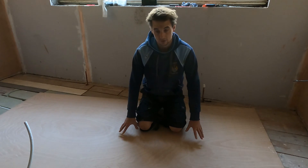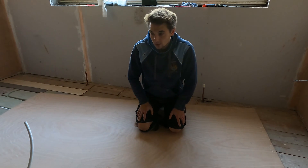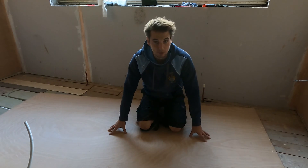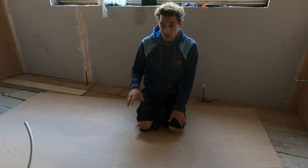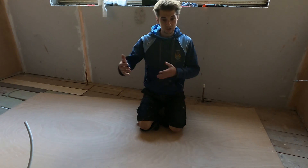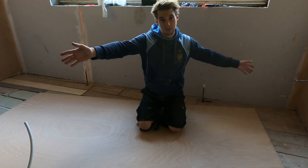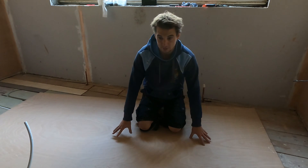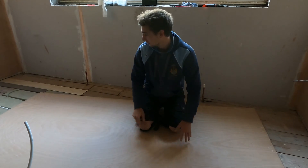For structural integrity of the floor, it does recommend you clean all the floor before putting anything down. The system recommends using 6mm ply; I've actually upgraded to 9mm purely because this particular room is extremely wonky — the joists are on two different setups, going from a high point to a low point towards the bathroom. I just wanted to give it as much help as possible with the least flex, so I've gone for 9mm to give more structural support across the floor.